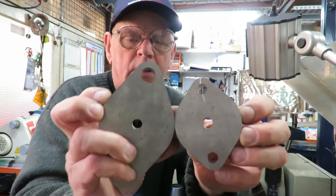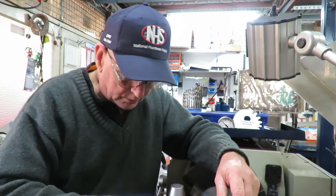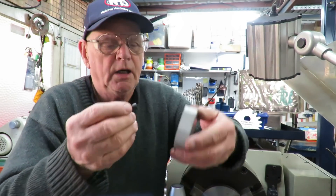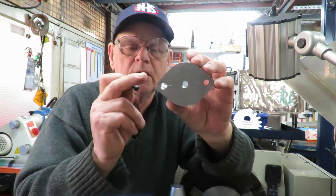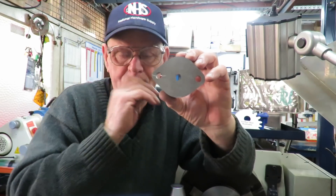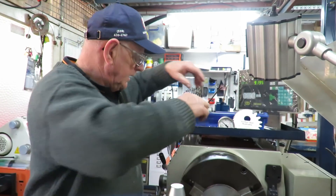I've got two sizes — the smaller and the larger one. In order to go about machining these, I came up with a plate with a tapped thread in the centre and using just two Allen screws. This one here is an M6, and that fits into the hole there. By bolting through here onto the plate and having that little screw there that works as a dog — just in case it moves — I can machine both facets using two tools. So I'm going to show you that setup and we'll run one.